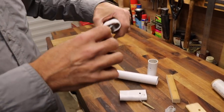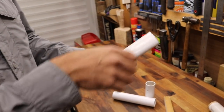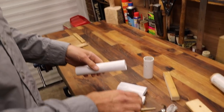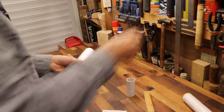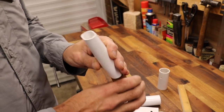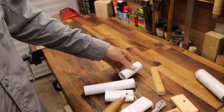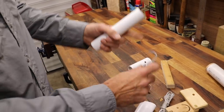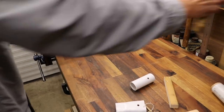We can boil some water, soften the pipe enough to flatten it, and it'll accommodate the blade better. When you push the blade in, it'll bite on that ferrule just like we did on the wooden box — push it in tight and then worry about where to drill the hole and fit the peg. We'll cut the pipe to about the length we want. For this particular knife it's about 90 millimeters — roughly three and a half inches. The goal is to keep it as minimal as possible but practical. It's easier to cut too much and trim back than not cut enough.